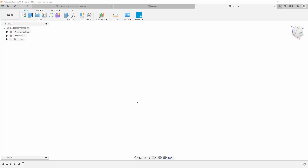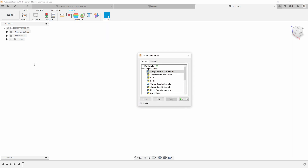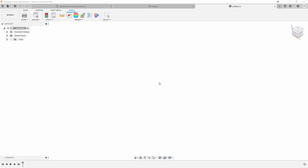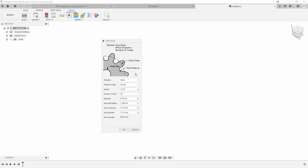So I did. When I was in Fusion 360, I had to go to Tools, then under Tools I had to go to Add-ins. In the Add-ins there is a Scripts and Add-ins section, and when you click this you will find a spur gear section right at the bottom. I went to this spur gear section and you will find a lot of settings you can work with.